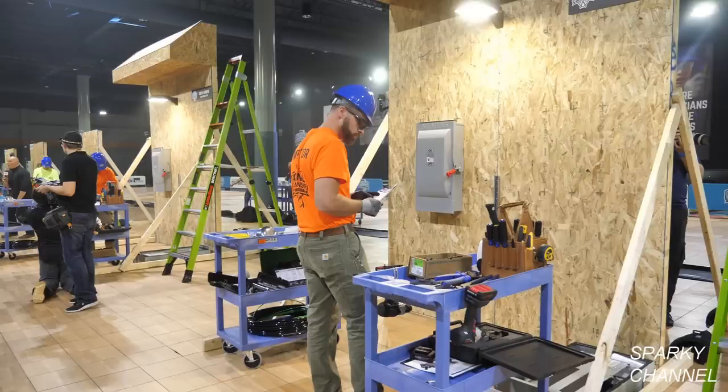This job site is an extension of an existing commercial building complex. The existing utility service drop is a 240-120 volt, three-phase, four-wire, delta-connected system. A Siemens 200-amp fused heavy-duty safety switch has previously been installed as the service disconnecting means for this installation.